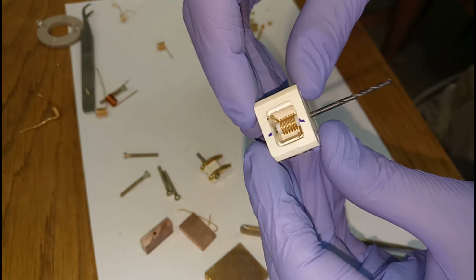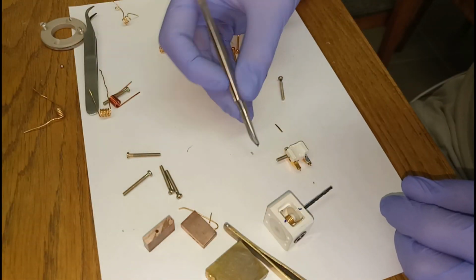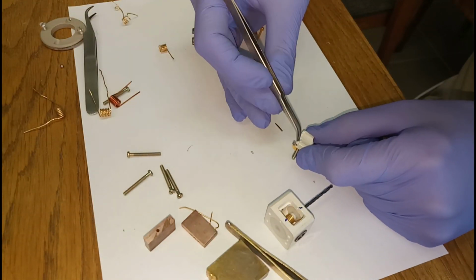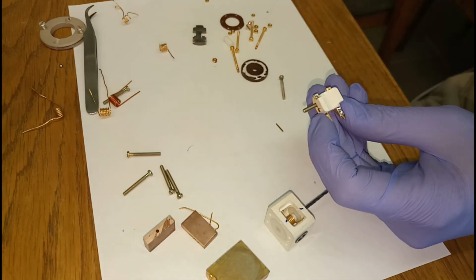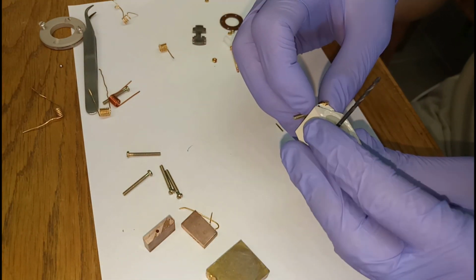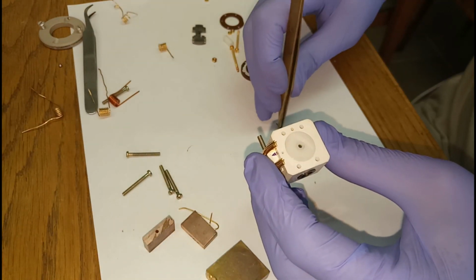The coil ends were bent to the soldering positions and were cut to length. Small pieces of solder were added to both soldering holes. The original coil was soldered in 2 mm holes. Old solder was drilled from the contact tabs.